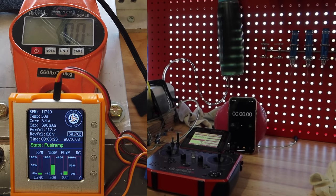Let's talk about it. All right, well, here's the results. I can't remember what my throttle stick was, but I think it was like 56% or something. So we'll review it on the video. I'll pop it up here. But this was our final results: 2 minutes, 37 seconds versus 2:19 on the 240. We got 1 liter of fuel for both. Both producing about 100 Newtons is where we had it set at. Throttle stick, 79%, and throttle stick at whatever it was, 56%-ish.